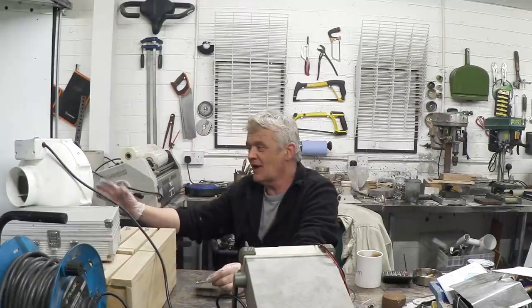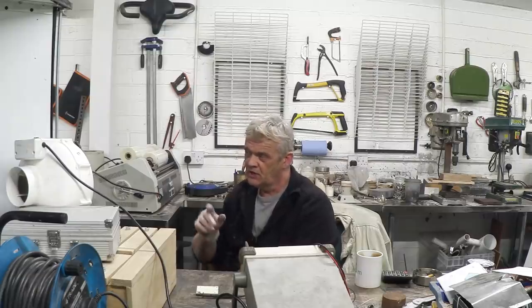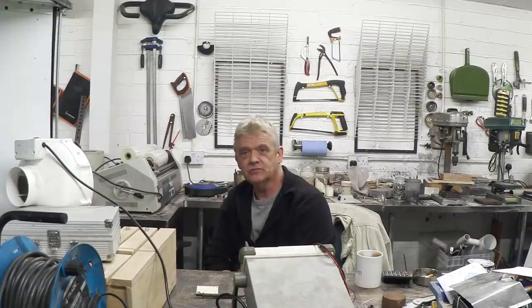I thought I'd share that because it's not going to change much from here — we're just going to add more. First we have to give some weatherproofing to the coil and electronics; not really a challenge — we can put it in a plastic bag, a plastic box, IP rated to IP65. I'm thinking of bringing each individual wire from the coil together at a main control unit. We can do that because we're using lots of individual coils. As I talked about in a previous video, individual coils give redundancy. Wiring up as individual coils and decoupling with a capacitor seems to be the way forward to get something like this working in very low wind speeds and generating in a way that can compete with commercial devices.